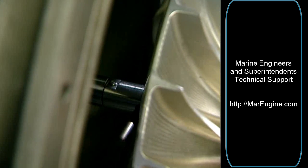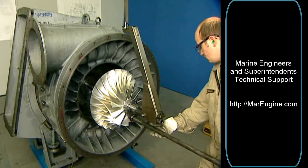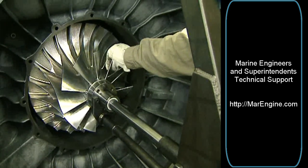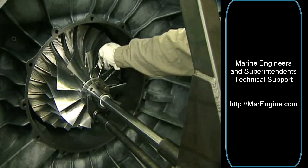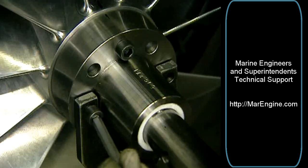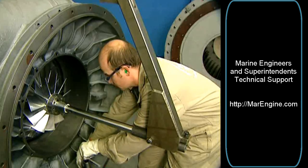Fasten the tube to the sleeve on the rotor with the pin. Pull out the turn pin. Align the compressor wheel with the balancing marks. Slide the compressor wheel onto the rotor. Remove the suspension device.